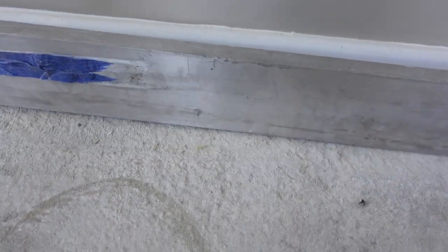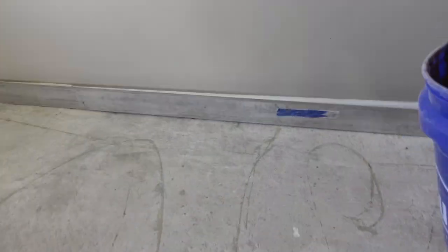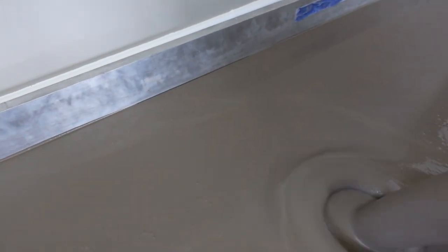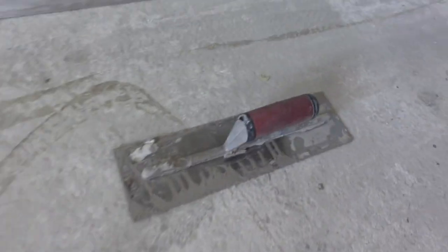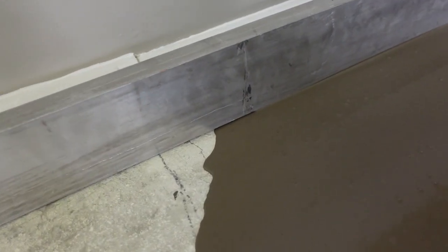We want to keep a nice amount of mud along the bar, but we want to keep it so that there's no light showing under it — so that we have it completely covered — and we'll drag the bar. Our focus areas are the lines we marked. We want to keep the mud field pretty thick so that we don't run out and don't have to stop. Pour it out there, get all the way to the wall, and it's going to need the most in the middle. Dump it all out and start mixing the next one.